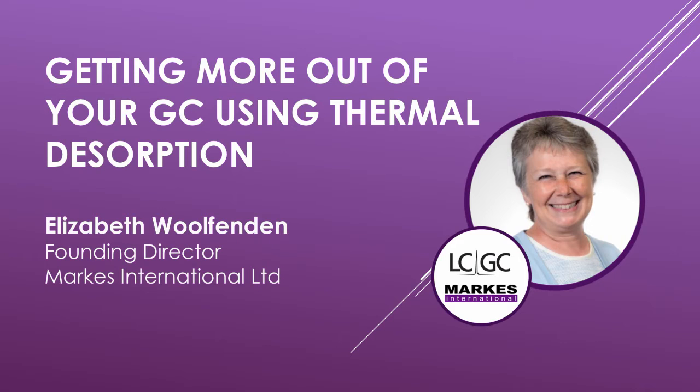Just quickly to summarize what generally happens: normally you have tubes that either contain sorbent or small samples of material, and these are heated up in a flow of carrier gas. Any volatile or semi-volatile organic compounds are released and go straight into the carrier gas stream. These extracted vapors are then selectively concentrated, typically in an electrically cooled focusing trap, and then injected super fast into the GC analytical column.